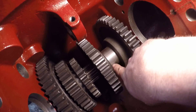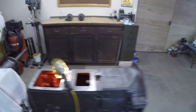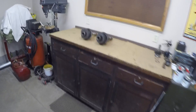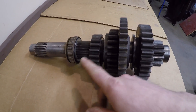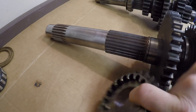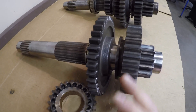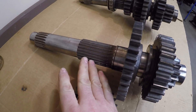But because this prototype design has this steel spacer and I cannot move the third gear forward, that is the reason why that top sliding gear shaft has to be partly disassembled to get it put in there. If it was a production setup, this is exactly how it could go in with the front gear on and front bearing thrust washer. Instead, I have to have these three pieces off. That's the reason why you have to basically install this into the case in a partly disassembled state and then get these components put back on.